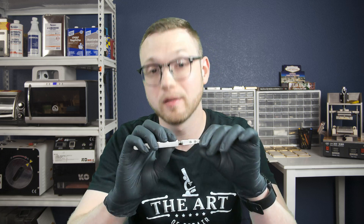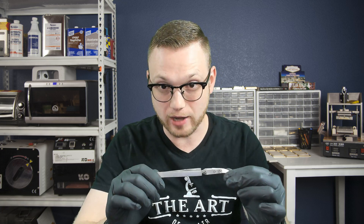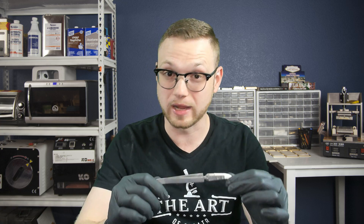Once we have our new short wick, which can easily be reloaded when needed, we can see that this set of tweezers has a special ceramic head. This head was put in especially to combat the next type of heat sinking, which comes directly from your tool itself. Don't forget, this tool is made of metal — a pretty good conductor with pretty high thermal conductance overall. This special ceramic head prevents heat from running up your tool, which can not only burn you but can easily take much of the thermal energy you're putting in.